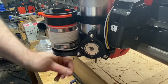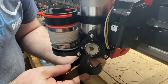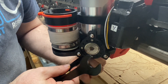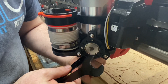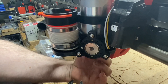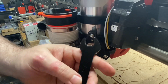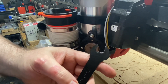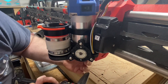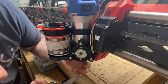I'm not sure if I twisted it beyond the flat place or what — it grips the flat place but with a ton of slop. Scratch that. I'm going to need to measure the width of that flat place and try to manufacture a wrench for myself that allows me to do the two-wrench approach, because I prefer it. I'm endeavoring to measure from flat to flat without removing the router from the mount.